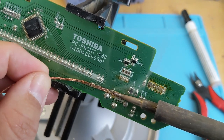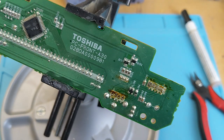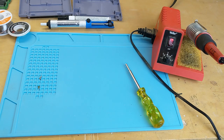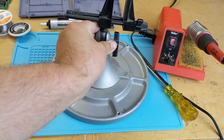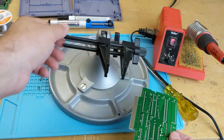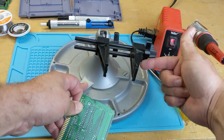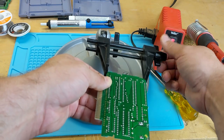Solder wick is great for removing large amounts of solder at once, but it is a consumable product. Note that the residue left behind from flux should be cleaned off as it promotes corrosion — a cotton swab and alcohol make quick work of it. I would also highly recommend a Panavise or similar stable work-holding system. Some people prefer the old-school third-hand accessories, but I've always found them a bit finicky. These aren't necessary for just one circuit board, but they certainly make life easier.